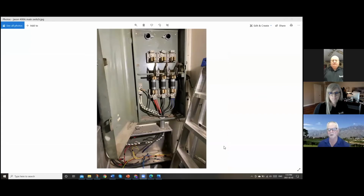So we started looking at it, and right away, I asked him if there was any markings on the outside of the switch. He said, no, there's nothing on the outside of the switch. It's just a 400 amp service, and you can see the old gutter box they were going to work on. So I said, well, hey, first of all, this never met code under old codes, and it certainly wouldn't meet codes if this was going to be a new install. First of all, I don't think this is a 400 amp service. It's definitely 400 amp rated switch gear and a 400 amp rated CT cabinet that you can see they were taking apart. But actually on closer inspection, this turned out to be parallel 1-aught copper, which means that this was a 300 amp service. And as such, it certainly needed to be marked.